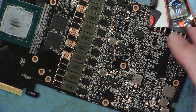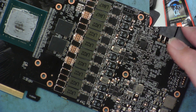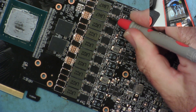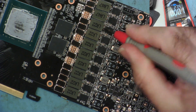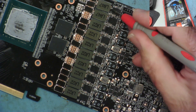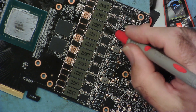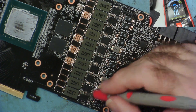On the other end of the board we have the core voltage rail, which is expected to be very low. These two here will be going to the memory controller or RAM. We have one, two, three, four, five, six, seven, eight phases.